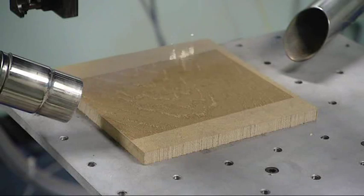There are a number of ways in which we can do that. One is by etching away the surface to give it a grained appearance, which we then coat, or the other is actually using an additive process where we're using a powder coat and selectively curing that using lasers.